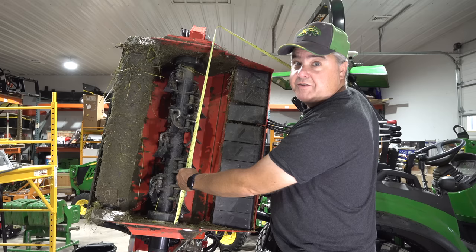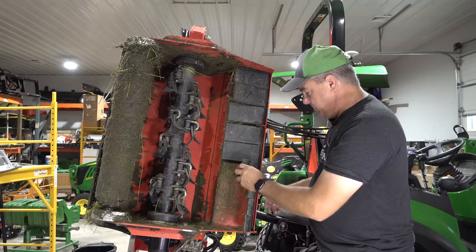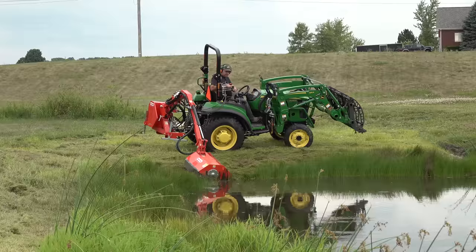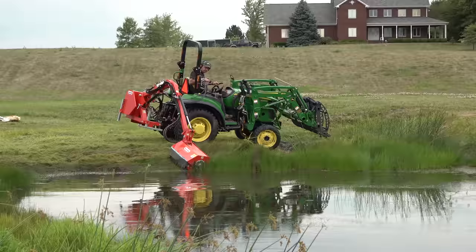Cutting width is a little less than 32 inches — they probably call it 32 inches, and that's all I would want on this particular tractor. On the front side, they've got flaps that you hardly ever see when you're running it. The idea is to keep stuff from being thrown out the front of the mower, and they fold back if they need to. This will run in both directions, which is unique. The PTO versions won't run in both directions — one direction is locked out at a time, so you can't quickly go from forward to reverse, which is probably a good safety feature. If you do want to run it in reverse, you move the main lockout lever to the other direction.